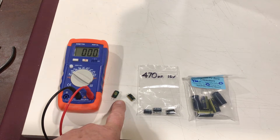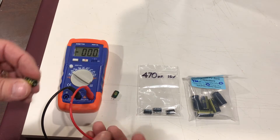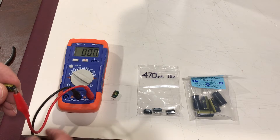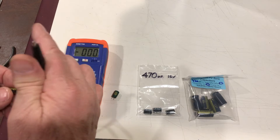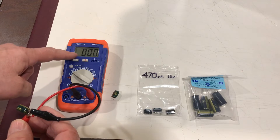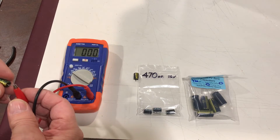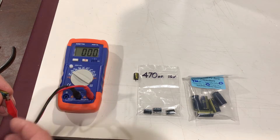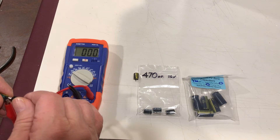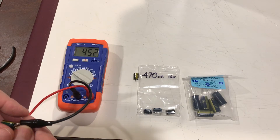Here's all the capacitors on the board — the two old ones that were replaced, a package of 470 16 volts, and a package of 470 50 volts. You can see there's quite a size discrepancy, so I stayed with the 470 16 volt just because they matched the same size and the same rating. Here I'm running one of the old capacitors through the checker — you can see it's getting a zero reading, meaning it was defective. The other one gave a satisfactory reading and could probably still function, but while I had the circuit board and power supply out I went ahead and replaced both of them.